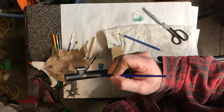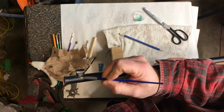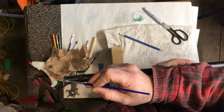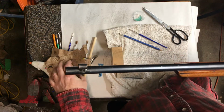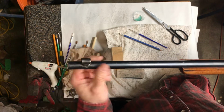And as you come down, we're going a little bit out more and more. Like we wipe down the whole area, so this is where we start to blend. And then you can see it little by little, the more coats you do, the less and less that scratch will pick up. And we let it sit, and I can see the whole area changing color, and that's what you want.